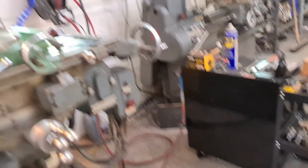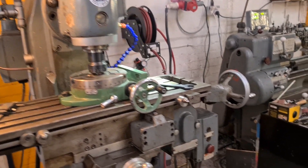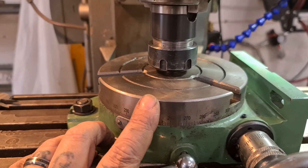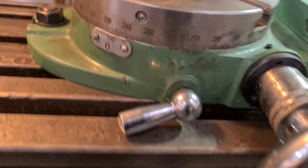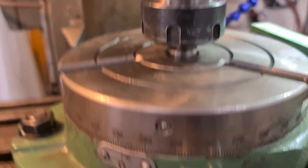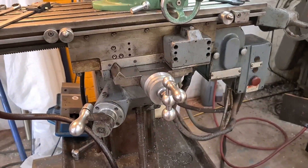What I'm doing now is setting the rotary table square in the mill. Tom Griffin showed this technique. My rotary table has a Morse 2 taper throat, so I've got an adapter that's Morse 2 taper and it fits in the collet — just poking out there. We square it up, get it about right, work our way in, then tighten it down and lock off. Bob's your jolly old.